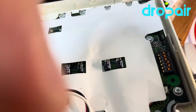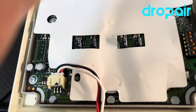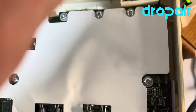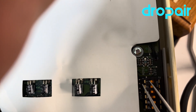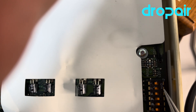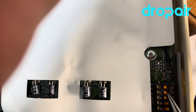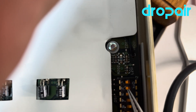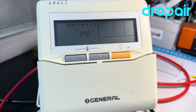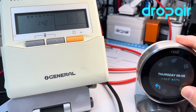If you connect together with the original thermostat, you need to put switches one and two to the OFF mode. This side is ON and this side is OFF — just put number one and number two switches to the OFF mode. That is the most important thing.